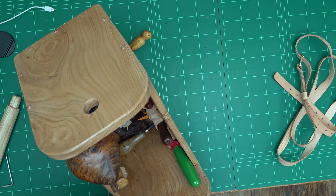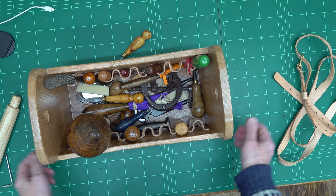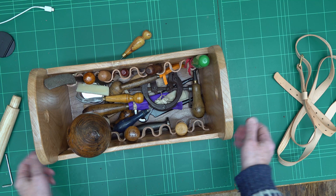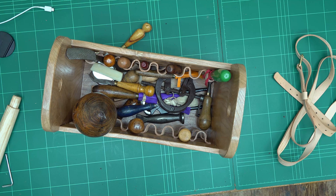That's the end view with a hole in each case. The bottom of the box I did as a jointed-in base — sunk in, glued, and nailed. You could do this quite simply if you wanted to, just using slabs of wood on the outside with no jointing — glue and nail would work perfectly.